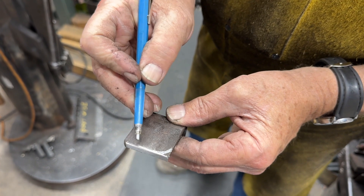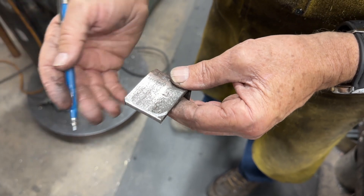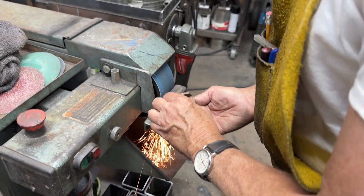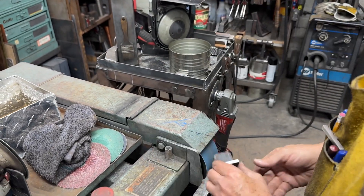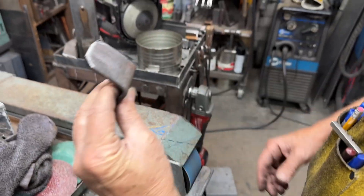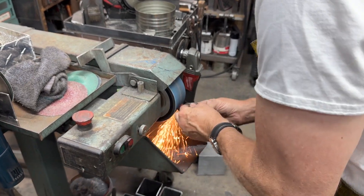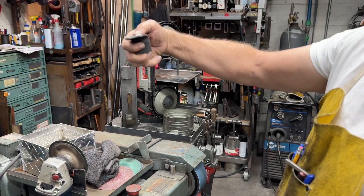This is our little handle and I want to make a little radius on these corners. So I'm going to come in on the belt grinder at 45 degrees — turn and turn, turn and turn — and quickly make two radii. This will be my first cut at 45 degrees. I'll eyeball what that dimension is, turn it over, do the same thing. Now I've got two started. I'll grind the tips off, radius it, and be done with it. With three separate cuts I'll lift this up and blend it in. Now we have a really nice soft little handle that's not going to cut your hands.